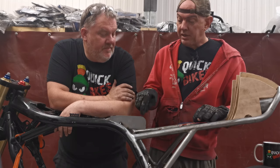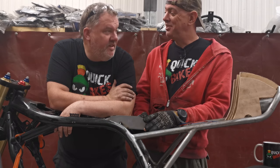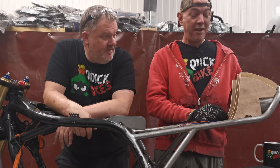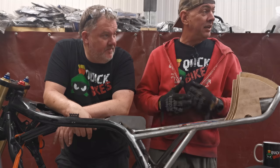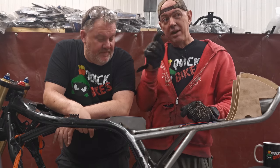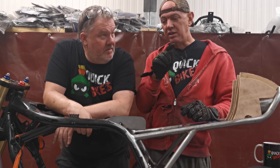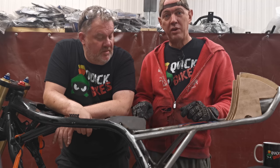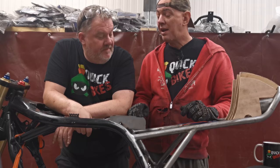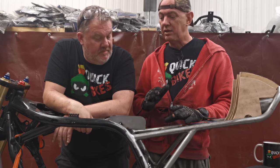Today I bent up this little box, which I'm very pleased with the way that Brenda performed. Brenda the Bender has performed exceptionally well. She did well. Very well, actually. And for a homebrew bit of kit that kind of made up design and everything else, worked a treat, didn't it? The radius, after a little bit of tweaking, we've got it down to about a 3mm radius, and this is on 1.8mm thick cold rolled steel, which is not too shabby, and there's no marks on it, there's no scoring, there's nothing. Really nice bend.